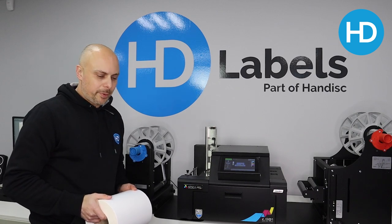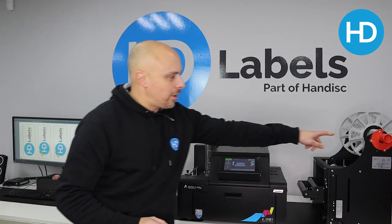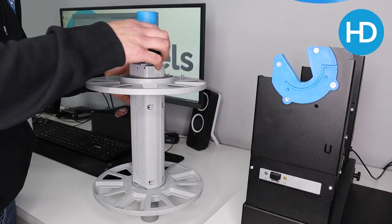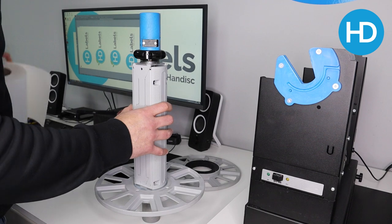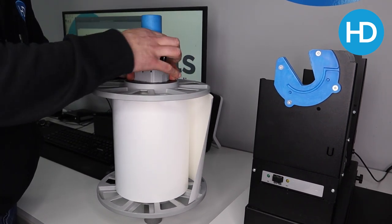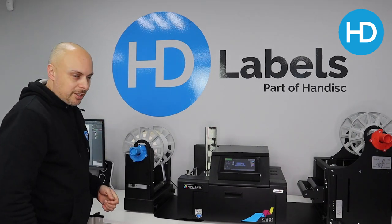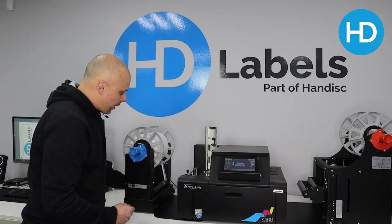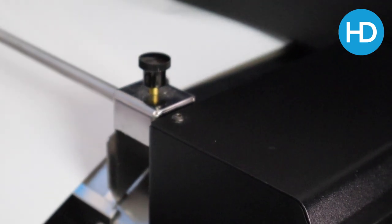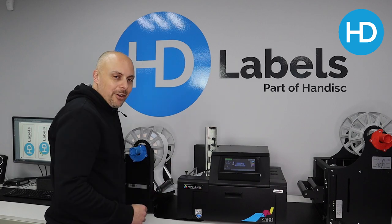Let's get the L901 threaded up. We've got a large roll of continuous material — this is 220mm wide gloss polypropylene. You'll notice the unwinder and the rewinder are colour coded so you shouldn't mix them up. These basically slot off — this is your spindle, and there is a core at the end which if we loosen will allow us to remove the guide. We place our material onto the core and tighten it up. The edges of each side are slightly bevelled so they can only go in one way, and it basically drops into the unwinder. With the unwinder off and the rewinder off to start, we can thread our material under the dancer arm. There's an adjustable guide on both the input and the output with a thumb screw. The back guides are fixed so you've got a straight edge through the printer, but we can loosen off the guide on the input and output to allow easier access for the material.